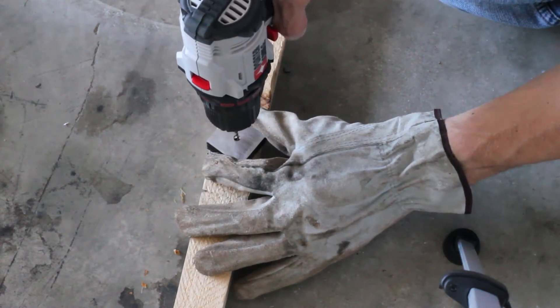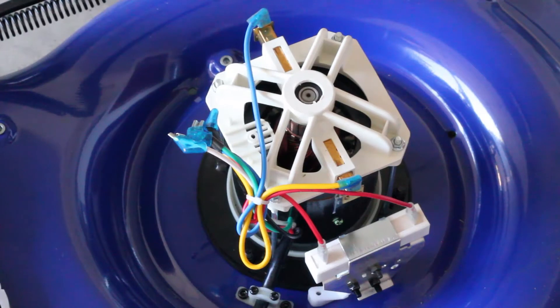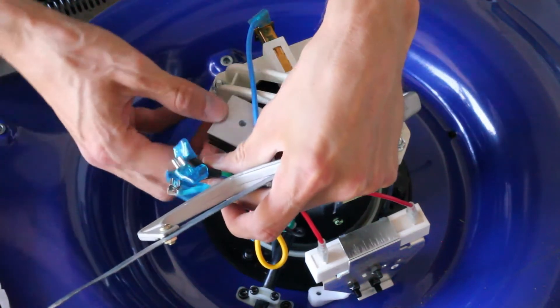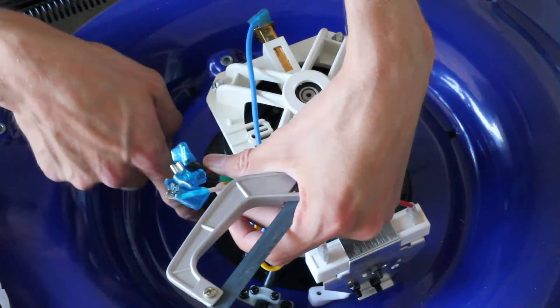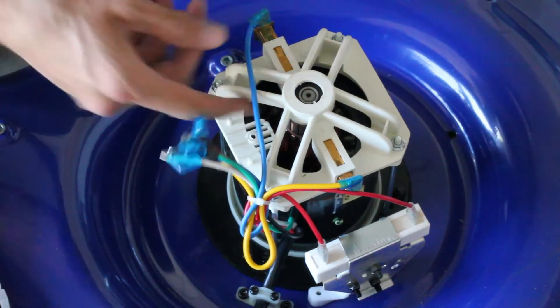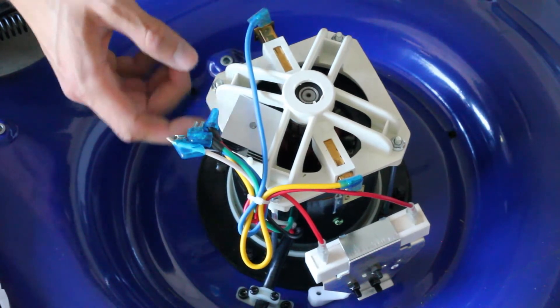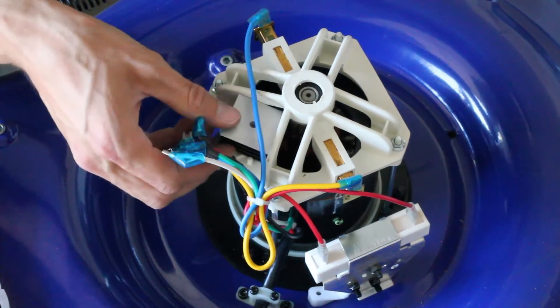In order to get the screw in, I'm going to have to drill this out a little bit — hopefully it doesn't grip too bad. It's not quite the safest way to go about it, but that's a good fit; now it does go through all the way. Slight change of plans: looks like we won't be able to use this heat spreader here, but we can put this on a diagonal and that hole lines up perfectly, so we can put that on a diagonal and it will fit right against there. The way this motor works is a fan on the bottom side connected to the blade, and it draws air in through the top of the motor and out through the deck. So when I put this here, it's perfectly positioned to draw a whole lot of air directly through this heat sink, so it's going to be extremely well cooled. I'll have to make sure I orientate it correctly — probably that way to get the best airflow.